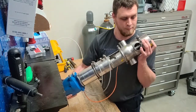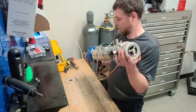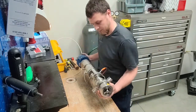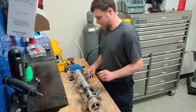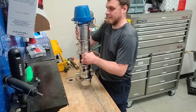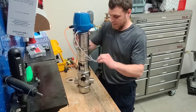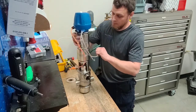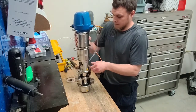This version that came out in 06 required that the leakage cavity be the same diameter as the largest process port, so these valves can be quite heavy. If you've got three-inch or maybe four-inch manifolds, you've got your work cut out for you when doing service. Three-inch and up are over 100 pounds each.